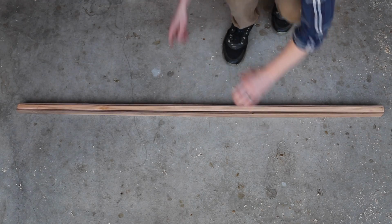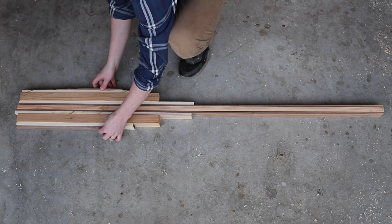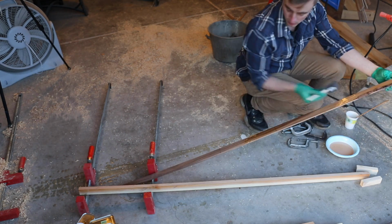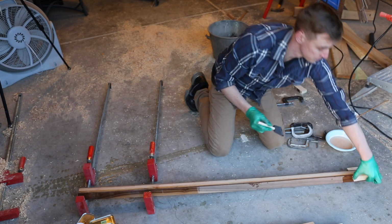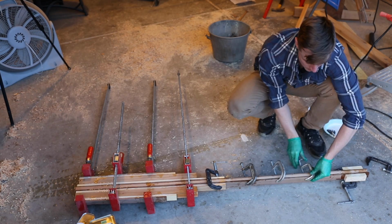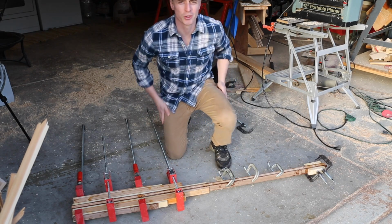Once all my strips are cut out, I line them up to make sure they all look good before I glue. I'd usually be okay with any water-resistant wood glue to laminate my strips, but I had some really expensive, completely waterproof 2-part epoxy left over from building the canoe, so I figured I'd just use that. So I waited overnight for the glue to cure.